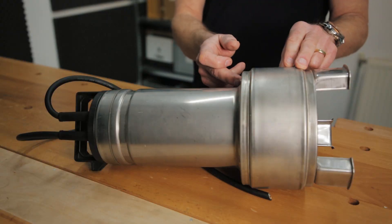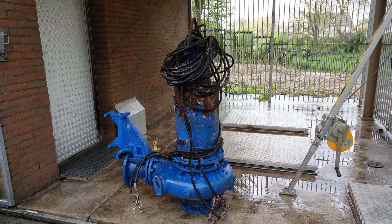There is always a small arrow on the pump housing, or you can check the installation and operation manual for the right rotation direction. In this picture you see a submersible sewage pump with a weight of more than 300 kilograms. You realize that the start reaction of such a pump can hurt you a lot, so keep a safe distance and always read the installation and operation manual.